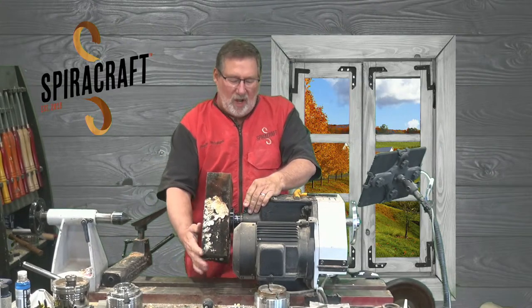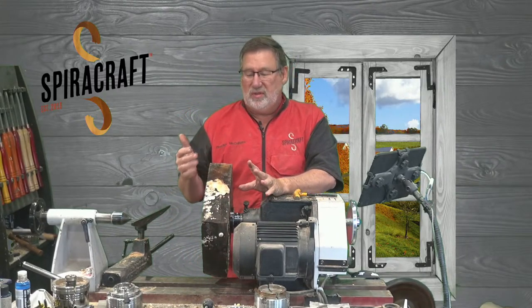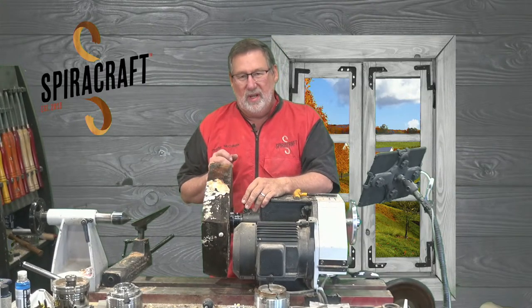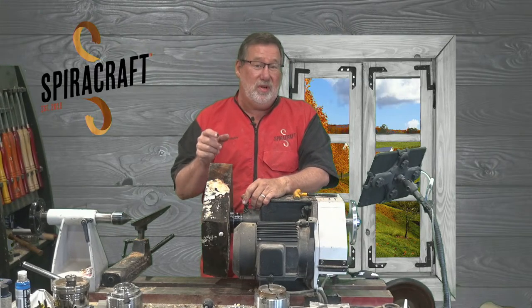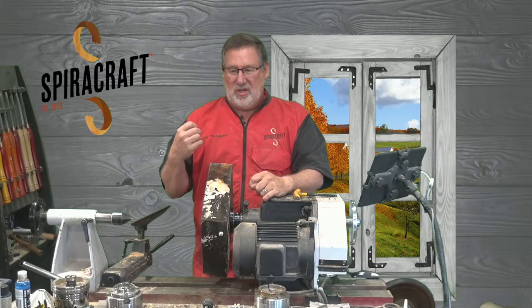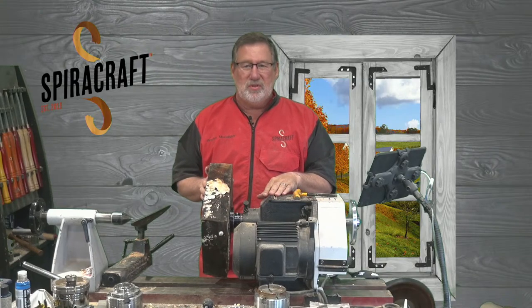Now, this wood is soft, so there's a little inherent risk there of the things working loose if it kind of bangs around. So that's something to keep in mind. Again, I didn't spend a lot of time doing any calculations, like zero time on calculations this morning, as to how deep the bowl might be and are the screws going to be too long. I just decided to err on the short side as opposed to the side of, hey, let's get 1.5-inch screws in there, 2-inch screws, and make sure we really got a hold on this thing. Again, I'll do as much as I possibly can with the tailstock up, so between centers, so that alleviates the chance of things trying to run away on me. So I take that a little bit and use that as my safety valve.